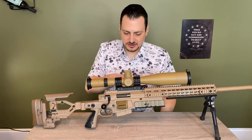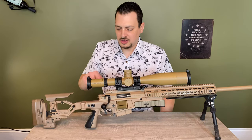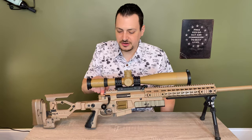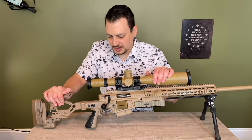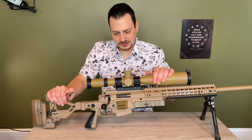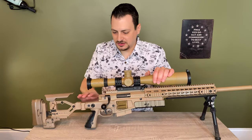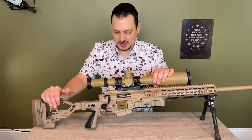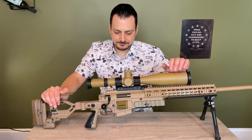When I put a new barrel on and check it with go/no-go gauges, I'll check it with the spare bolt. The head spacing on this bolt is about two thousandths of an inch greater than on my spare bolt, so as long as it closes on a go gauge I'm good. Spare bolts are very pricey — close to $900 for a bolt assembly. I haven't found them in different colors; my spare is black. I don't ever plan on using it, and I'm sure I could sell it to somebody who has one with a large firing pin hole.